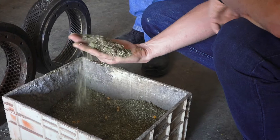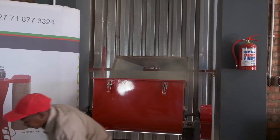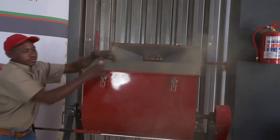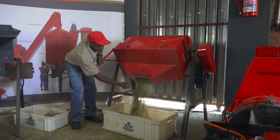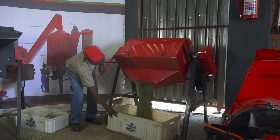Once the roughage has been prepared and you have made a decision about the concentration of starches, the ingredients can be mixed to obtain an even distribution and to prevent the segregation of components. In many cases, only a well-designed mixer will suffice, as different ingredients have different weights and tend to easily separate.